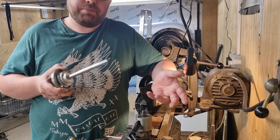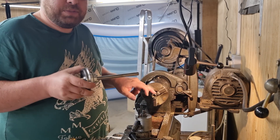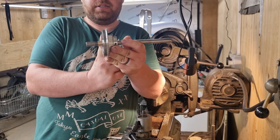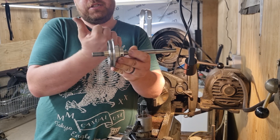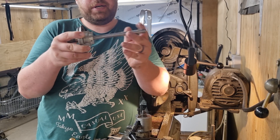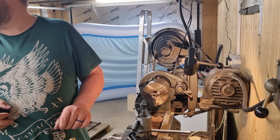That's why this one didn't move. If you go back to my previous video I explained when breaking it down what actually happened - one of these wheels moved. So I'm making two of these bushings to eliminate that, because the flange here where the rail is stops the wheel going that way, but on the other side there's nothing to stop it going that way. That's why I've made that.